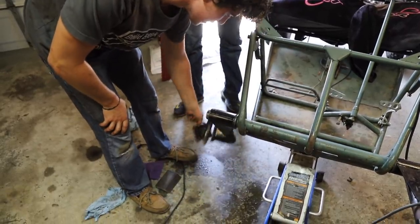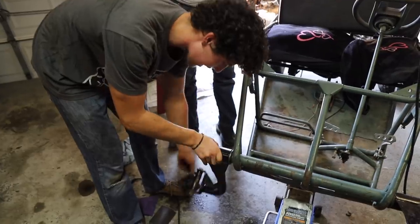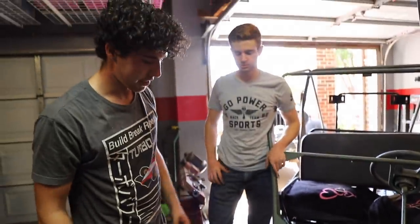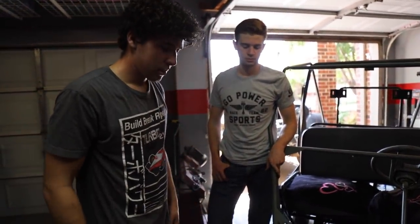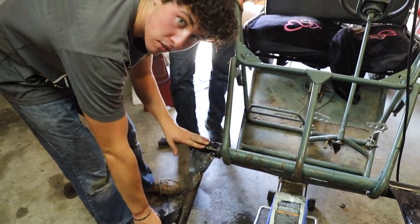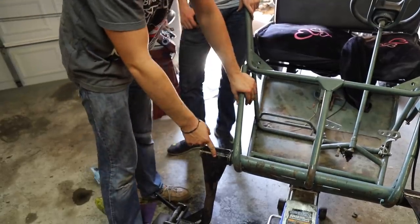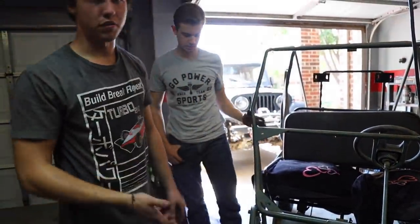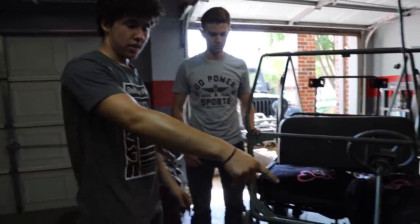This is what it should look like. We sanded a lot of material off because we prefer it looser, and if it ever rusts a little bit, we'll be covered. We did drill a hole here — later we're going to slide these off and put in a grease fitting, because I think a healthy amount of grease is really going to prevent the rusting that occurred. Now we need to do this all over again on the other side.